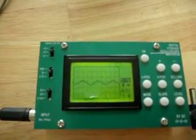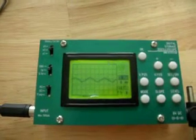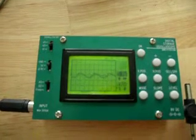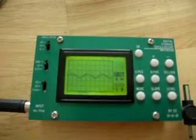In the past when I've done this test, before I re-engineered the grounding of this house, I was getting 2 volts peak to peak — so it's actually halved in value since I put the new grounding system in. That grounding system has been tested at 12.8 ohms to ground. The National Electric Code says your grounding system should be 25 ohms or less, so we're within the NEC guidelines now.